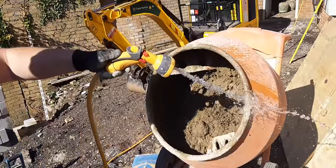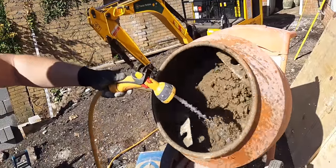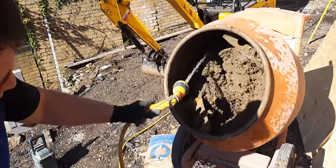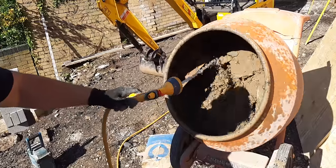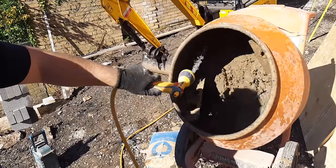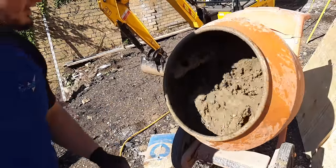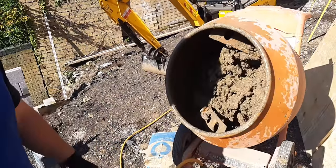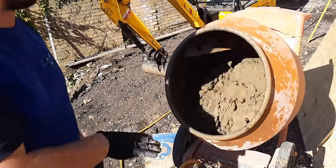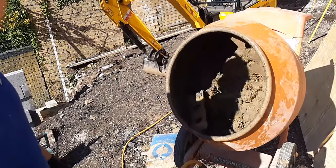Now that is very dry in here. I've got another four-and-one of sand and cement. I'm trying to get it right before the end, so I don't want it to be too wet. So I've got all my water going in — that's going to take a lot of water now because this sand is very dry. As you go in, make sure you keep your mixer really, really clean as well. Especially the first mixer of the day — you should have it absolutely clean from the last time you used it.